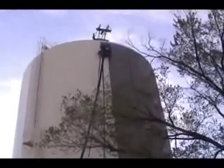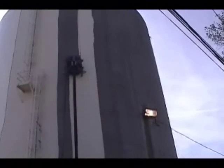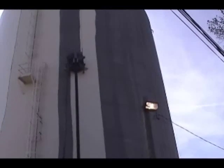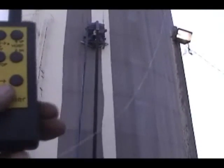The shot stays in the machine and is recycled over and over until it breaks down enough to be drawn out as dust. During the recycling process, an air wash system separates the paint dust from the heavier shot. The paint dust, rust, and spent shot is carried down to the dust collector through a 6-inch diameter hose. The dust collector automatically deposits the dust in a 55-gallon drum. When the drum is full, it is detached, capped, and a new drum is attached to the dust collector.